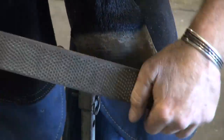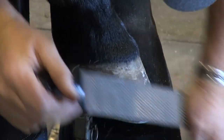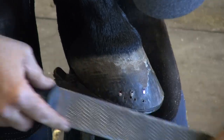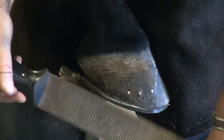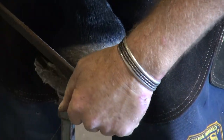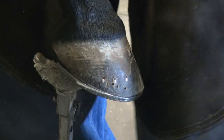First of all, your first strap is two nails. Maybe you don't sink the first nail all the way down. Get it started, the shape of the nail holds the shoe in a very close position to where you want it, or exactly where you want it. If you sink the nail head in, sometimes it'll shift that shoe because the nail will lock into the hole. It'll move one way or another. Recognize that it's done that. And then with the next nail, use that to your advantage, shoving the shoe exactly where you want it.